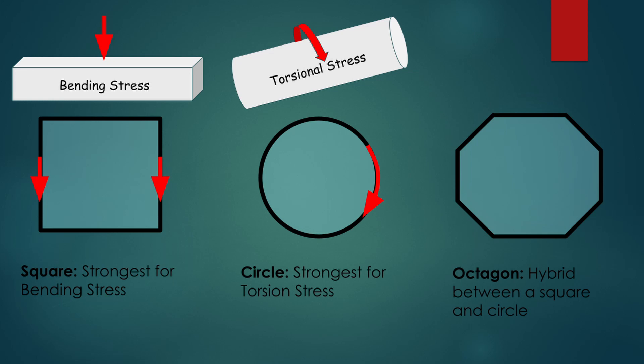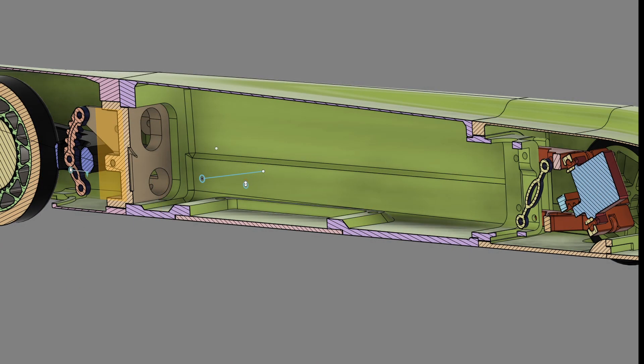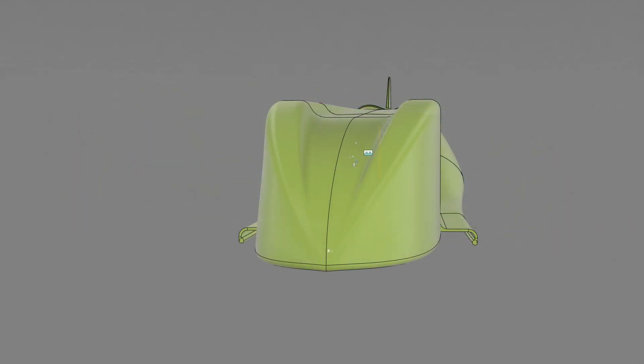The bottom of the monocoque will experience the most stress, particularly on a 3D printed part, because the skin will be pulled in tension and will actually need to be thicker so that it doesn't separate at the layer lines. The top of the monocoque is actually under compression and can be made quite a bit thinner. If you look at my RC Streamliner monocoque, it's basically a square with a thick bathtub portion at the bottom handling the bending stress. The Streamliner is very narrow and its wheels are actually inside the monocoque structure itself.